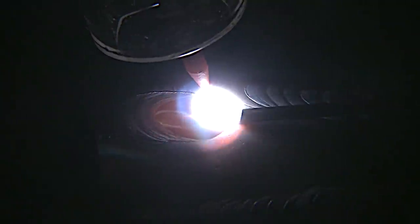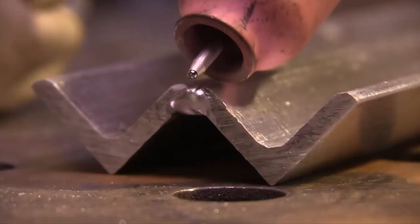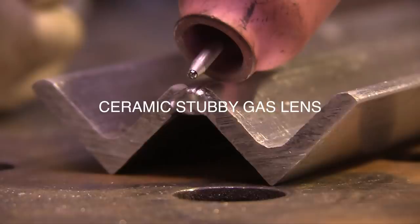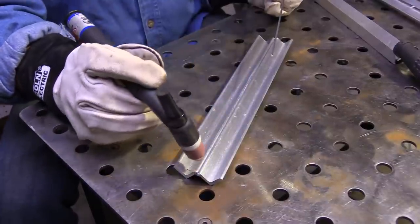This is about 100 amps just running a bead on a piece of stainless round stock. What I'm going to show you right now is using a regular ceramic cup on an aluminum outside corner joint. First off, I'll run this joint using a stubby gas lens. I really like the stubby gas lens hardware on a 17 torch - just feels better to me and it'll do a mighty fine job.